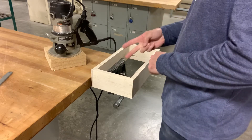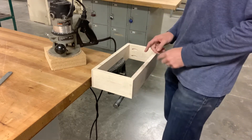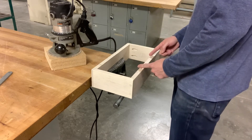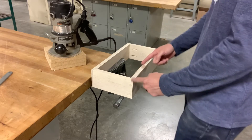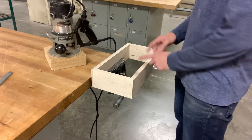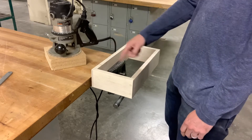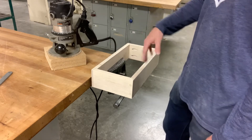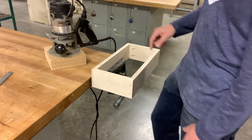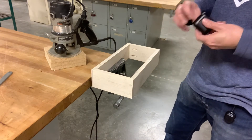We're making two passes as we go around. I'm going to do it in about six-inch segments — scoring pass, then come back and clean it up — all the way around the box. It doesn't matter where I start because I don't have any end grain to cut here; it's all surface and edge grain. I'm going to start somewhere in the middle and work my way around. This is very loud so you should have earplugs.